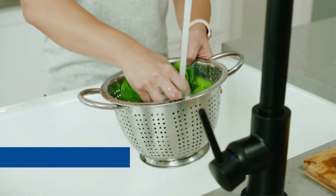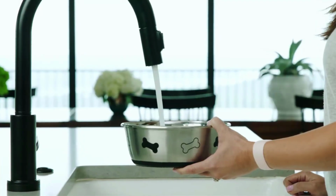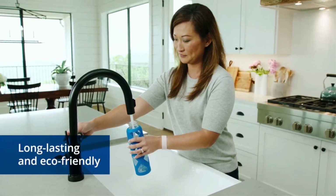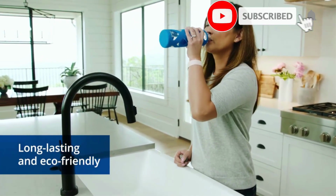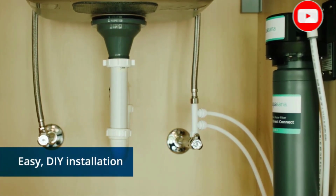As far as the flow rate and water pressure are concerned, the Frizzlife pours water at 2 GPM and 60 psi. And compared to other under-the-sink water filtering systems, this model requires you to change only the core of the filter cartridge instead of throwing out the entire plastic casing, which is better for the environment.